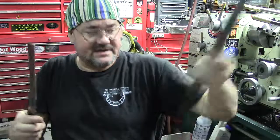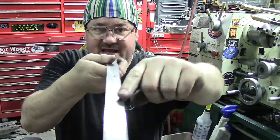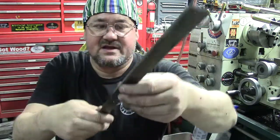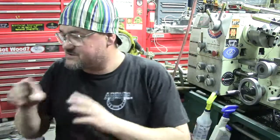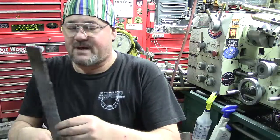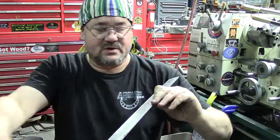These were epoxied on. I'm going to epoxy the new ones on. Same thing with this one. This actually has an edge on each side. You can see it here and here. I'm going to clamp these down, and I am going to machine some oil grooves in them. And here was the one on the bottom, and you can see in the middle here that there is no oil groove. It's plumb gone.